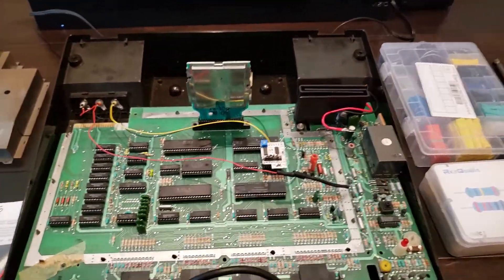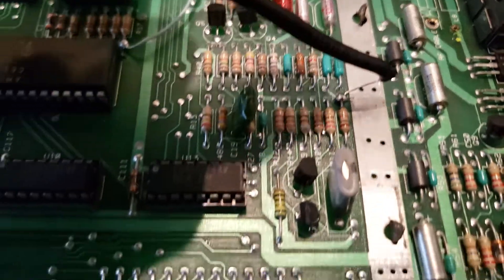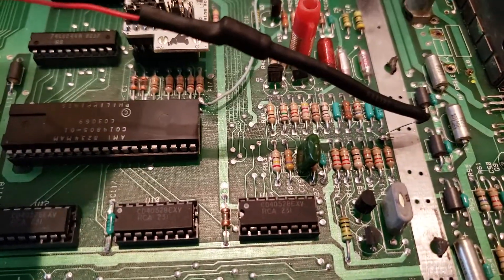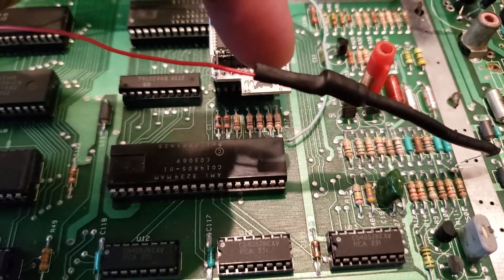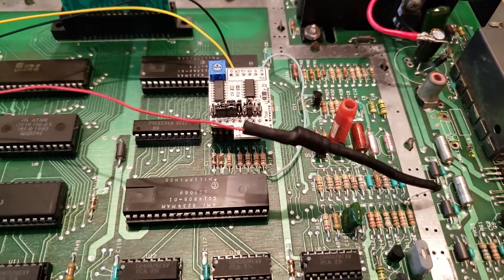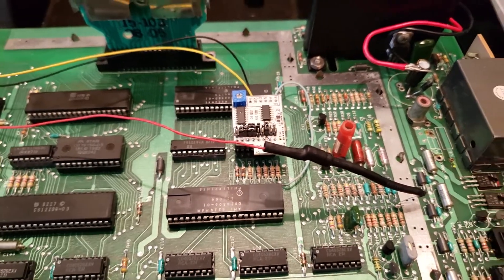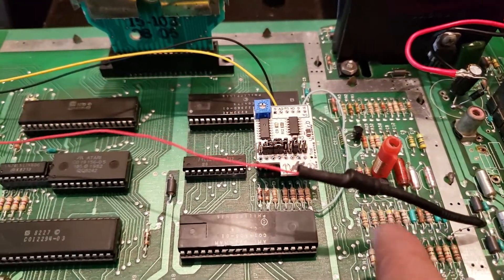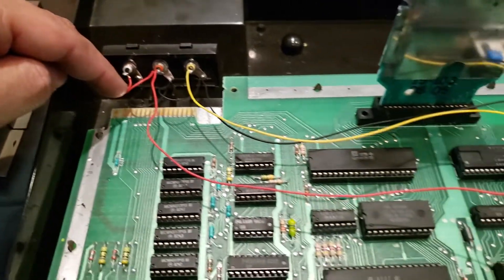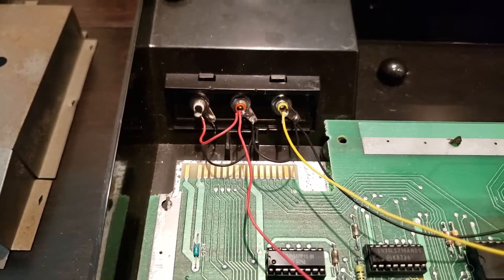For audio, this was actually tricky. I followed some instructions and connected to resistor R50. Under this shrink tubing there is a 2.2k ohm resistor connected to a capacitor — this is to make the audio not too loud and not too distorted, as far as I heard. The red cable is connected all the way to both jacks. Remember, this is a mono device, so technically I could have just installed two jacks instead of three.